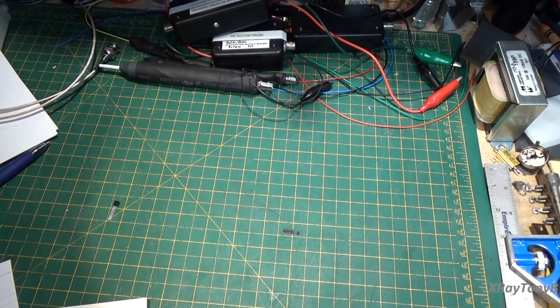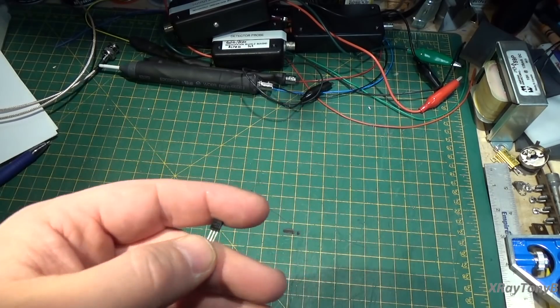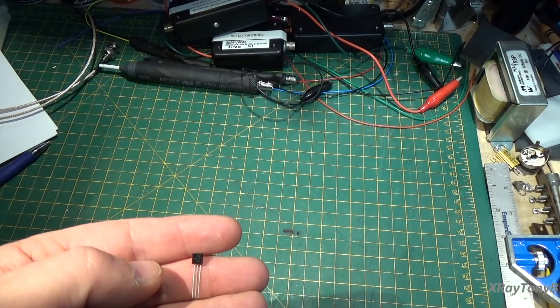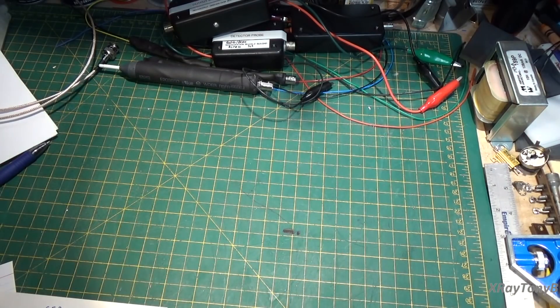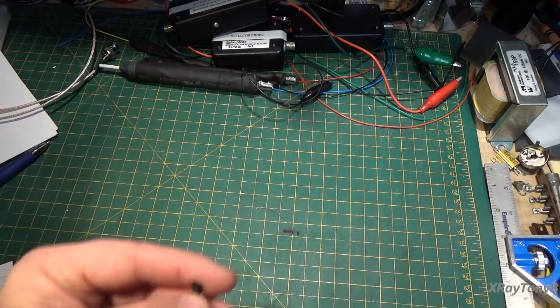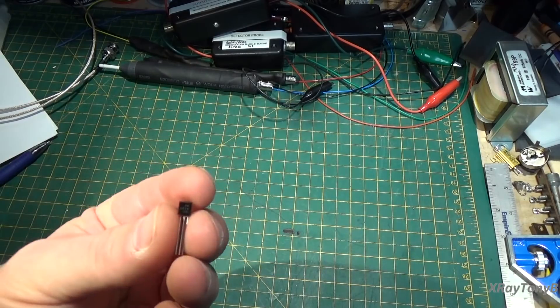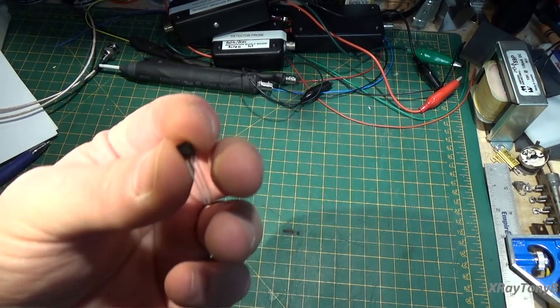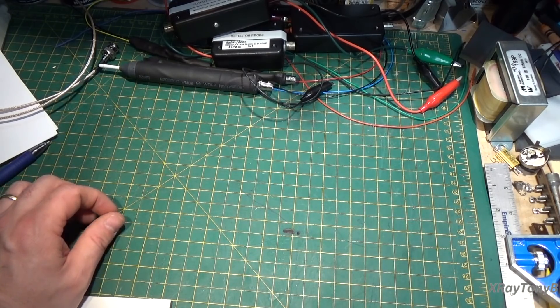Here's the bigger issue. You can go online and look up a data sheet very easily for a transistor. Just go into your search engine and type in, for instance, '2N2222 data sheet.' You'll get a whole bunch of hits. Look for the ones that have the word PDF in parentheses — that's a direct link to the data sheet. Download and print it out. You'll get the specs: how many volts the transistor handles, wattage dissipation, frequencies, gain, and all those different things. When looking at replacements, you'll at least know what specs you need to fit the bill.